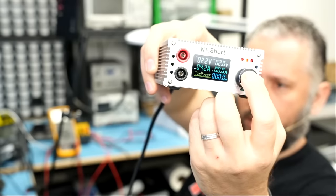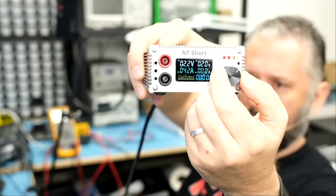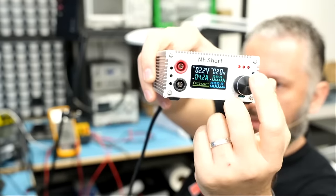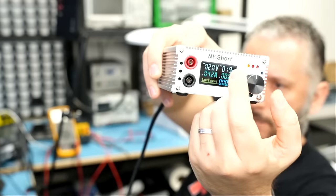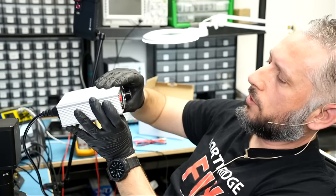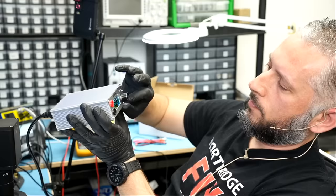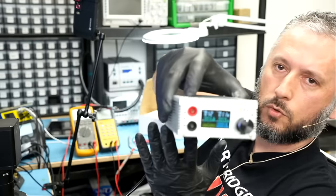And if I press the button again, I can set the controller to beep or not to beep. Like now, I set it to beep. So if I press to change my voltage, now every time I turn that dial, it beeps to indicate that voltage is increasing or decreasing. Now, I have this voltage injection tool set at 1.7 volts and 0.6 amps. I want to go to 1.2 volts. Maybe we can start with 1.2 volts.